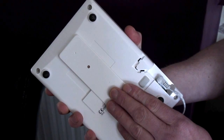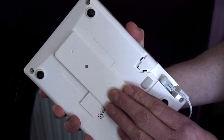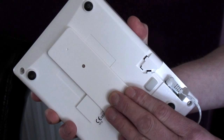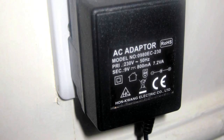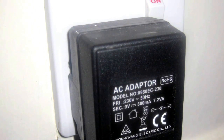If it is a panel tamper fault, try reseating the control panel on the wall mounting backplate, which we have shown here. Also check the mounting plate for damage to the two fixing lugs. If AC power fail is displayed, ensure that the power cable is plugged in and that power is being supplied to the control panel.